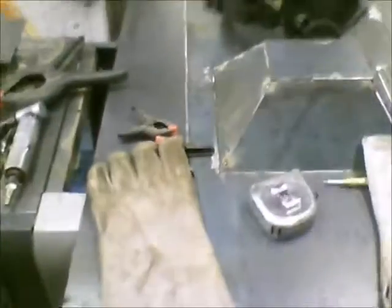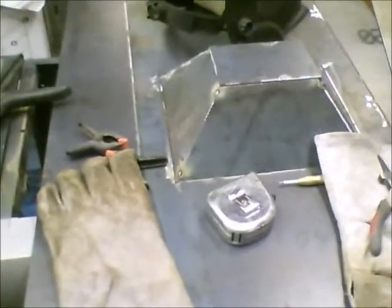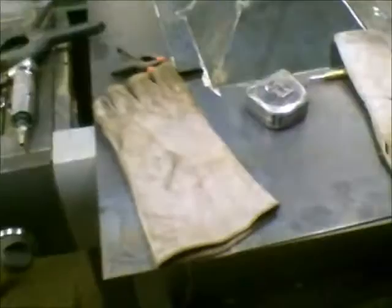I've also been doing a little foray into forging — we wanted to start making knives. So I took this defunct grill unit that a friend gave me, which is ironically a twin to the one I still use at home. We took the grill housing off; all the baffles and burners were just burnt up. So what we did was take the top off, and I'm cutting out this plate — the smaller of the two plates here in the center — which is going to lay over the top and be the fire pot.